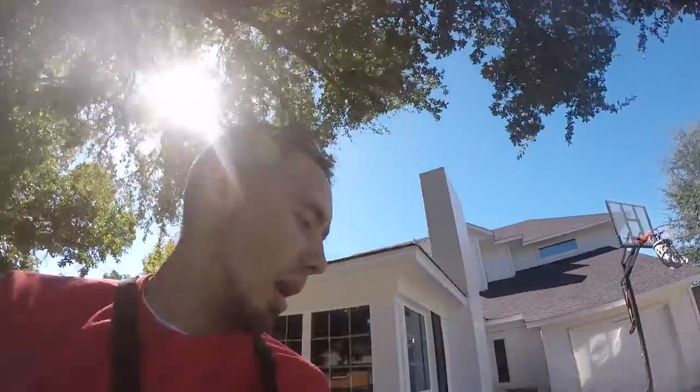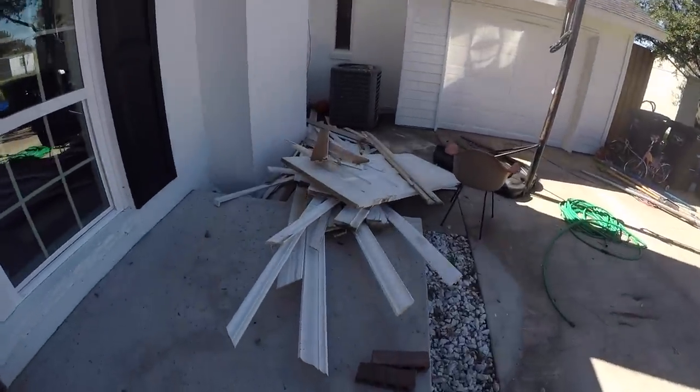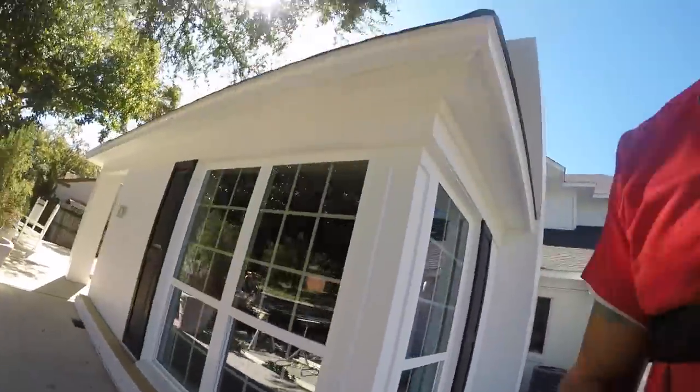Welcome back to the job site. Today we are installing a lot of trim in this house — we've torn a lot of the trim out, you can see a big pile of trim and doors. We're also retrimming the windows, and there's one window on the stairwell I'm going to trim out. I'm going to build it all outside and pop it in as one piece, just build it out here on the porch, put the casing on it, and slide it in.